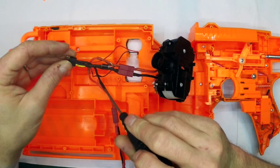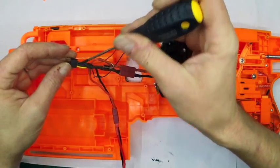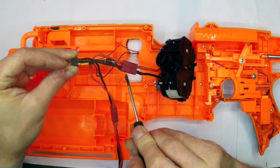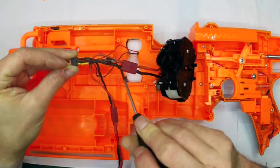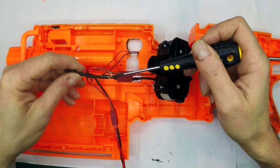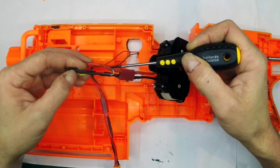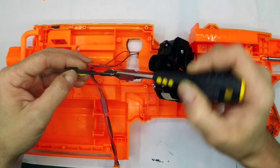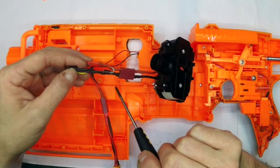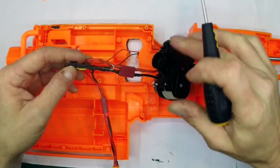Now there's some confusing wiring colours because I didn't have the blue in here — this would normally be a blue which is a feed to the motors. So we can now do the final pin, which is the drain in the middle. On the drain you have a line going from the drain straight to the negative of your motors. You can see I've got my usual plug-in motor block here, and here's the diode. This is just a straight rectifier diode — the silver end is connected to the positive feed from the battery, and the other end is connected through to the motor block. That just means that normal operation doesn't allow current to pass back the other way, so it stops current from being passed the wrong way through all of the electrics.